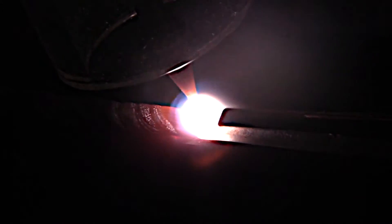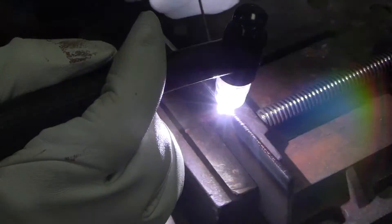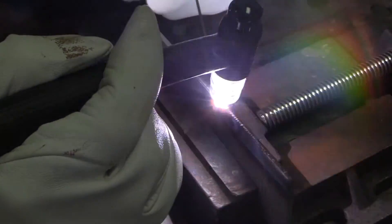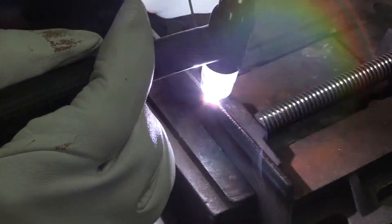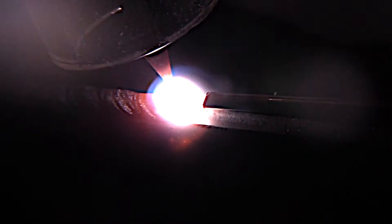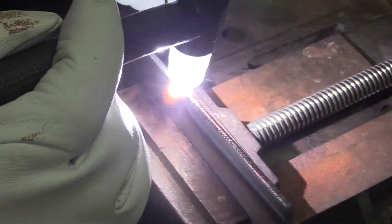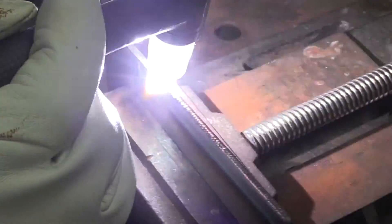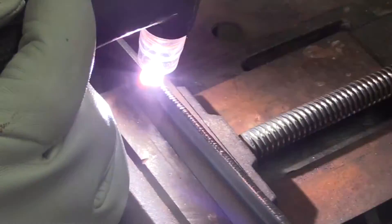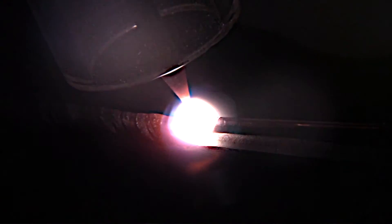And that's the biggest difference for high speed pulse. It's not like night and day — you can definitely do this edge weld without pulse at all. But it just gives you a little bit of an advantage, a little edge. You can daydream for a second and lose concentration and still not go overboard and roll the bead way over the corners. It's another tool in the tool belt is all I'm saying, and I like to have a lot of options. According to my good buddy JD, options can make you money.